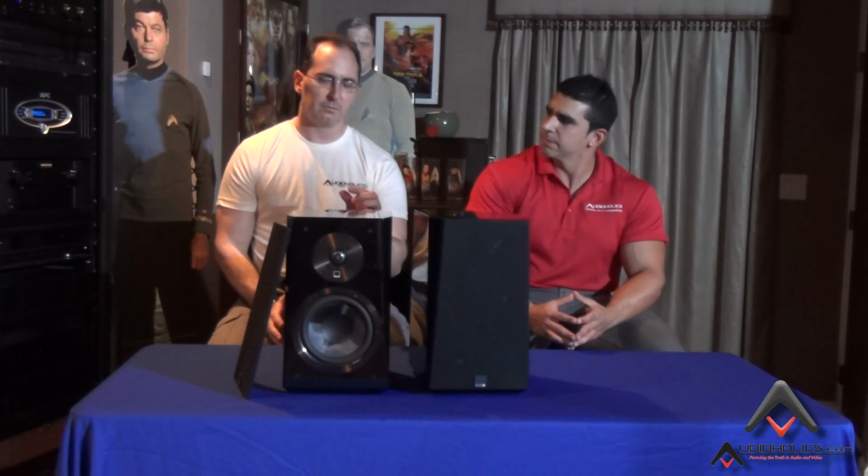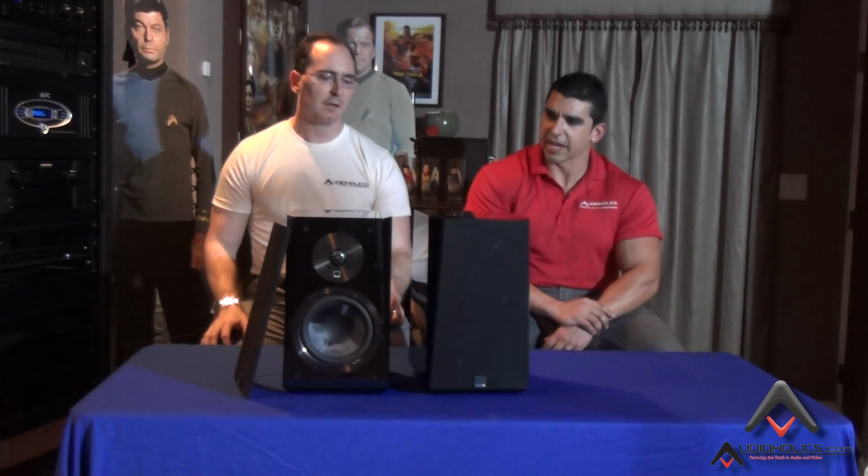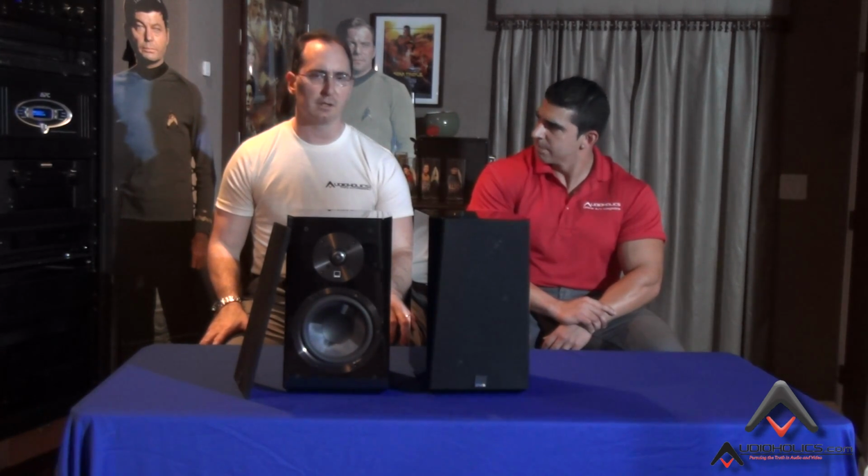It doesn't have a vented pole piece like you see on subwoofer drivers, but what is really cool is it's got these little holes, like little punch outs almost, by the cone. It's really close to the former itself, so what that does is reduce the turbulence of the cone, of the voice coil. Yes, and it also acts a little bit as a vent as well, like a pressure release. Exactly. So the woofer was very well thought out. It's a very high quality component.